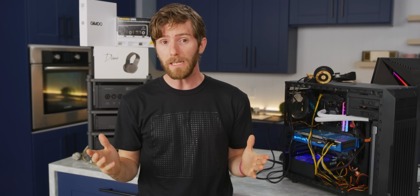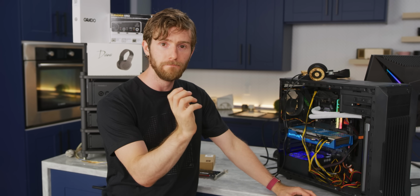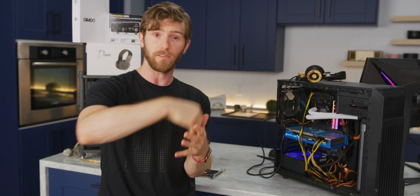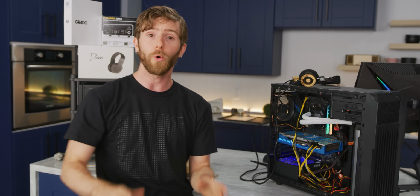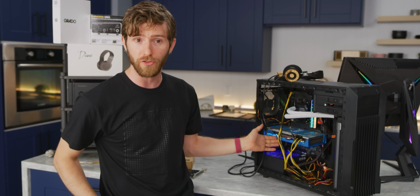But that doesn't mean that switching power supplies, like this one, don't have any downsides. And one of them is that they create more electrical noise. If you've ever turned on a speaker and heard a hum or buzz when no audio is being played, that's exactly what I'm talking about. Quote unquote, dirty power can rear its ugly head from the external supply, things like voltage spikes or low or unbalanced AC power, like we have here in our building, or even internally within the system after the conversion to DC from components like graphics cards or other chips.